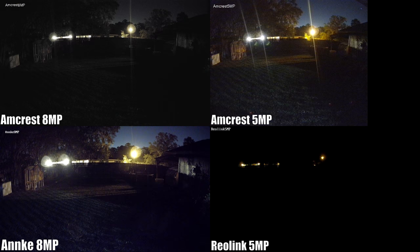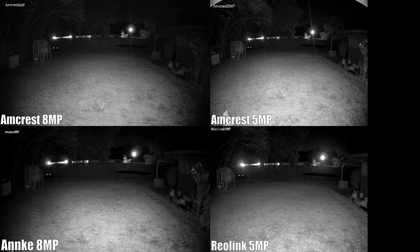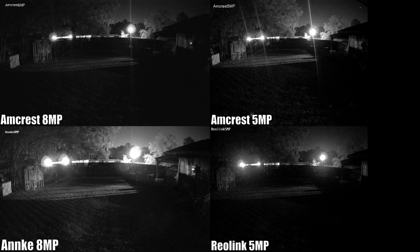Now, this is a color night shot, and this backyard is very dark. So do pay attention that sometimes more pixels is not better, because now you have to feed those additional pixels more light. And if you don't have much light, it becomes difficult. We did turn off the IR on each camera and turn them on one at a time, that way we would not see the IR from each different camera.